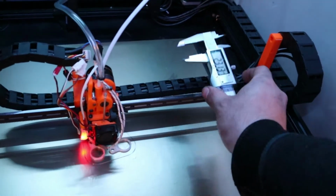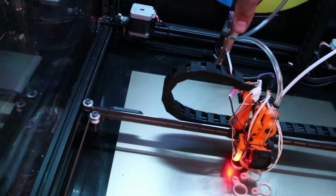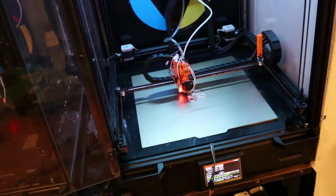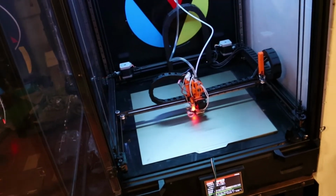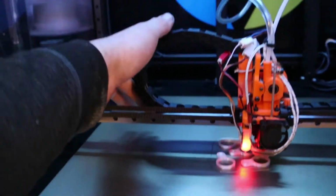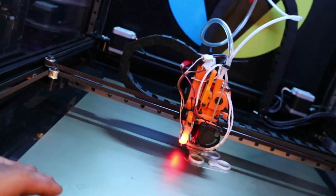Yeah, this is 23 on the outside, but 12. So its inside is 20 by 10, I'm sure. So if you order a 20 by 10 IGUS chain, that should be fine. You can go possibly to 15, because this can actually bend a lot more, but we just don't want it to, because you want the wires to be a nice smooth arc like it is.